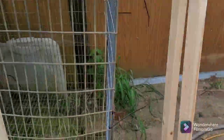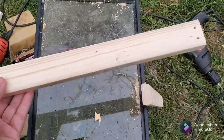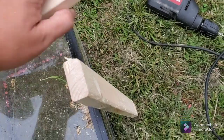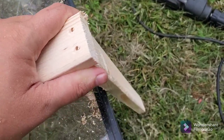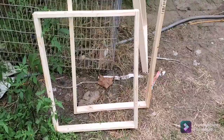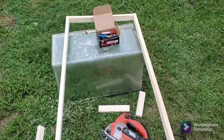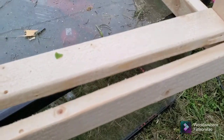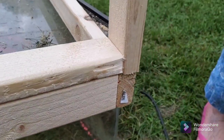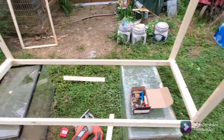This would be the top or bottom — you need two of them. Then take a 22-and-a-half by 16 piece and make sure this is on the outside. It's called the outside, and then you screw them inside. You need to do two of these, so you should have two of those and two of the big ones. Then lay one flat and line up the corner so it's flush — your side should look like this when it's all on.